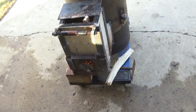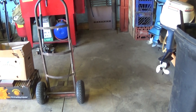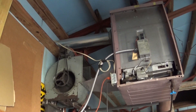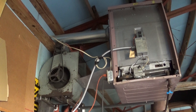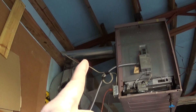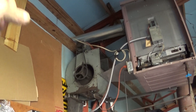I'll show you where I want to put it — this is going to go over here. It's got lots of room since I put the two snowmobiles in the trailer. Right back in here, because right up above is my furnace. What I'd like to do is take and tie that pipe into the exhaust for the furnace, put an elbow up in there, and then put a damper between where the pipe goes in and the furnace — so that when you run it, it doesn't suck back into my shop; it'll go out and up outside.